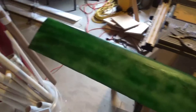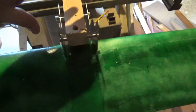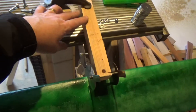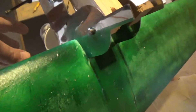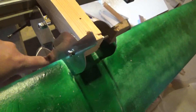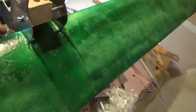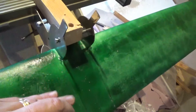Alright, here I have a wing. What I did was I drilled a quarter inch hole through this wood and stuck one of the pivot pins through there. I need to balance this — I've got that wood clamped to a platform. I've got a paper cup hung to this bolt, and this is where I want to hang the weights. So I just put a little hook and then a cup there. I've got these inch and a half washers I'm using for weight and I need a lot of them.